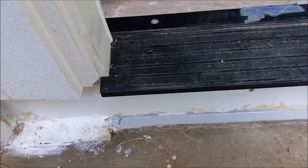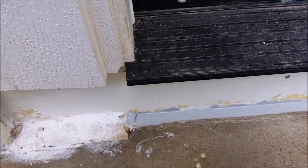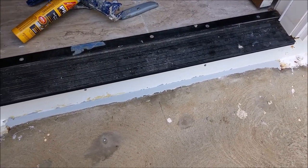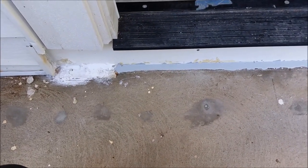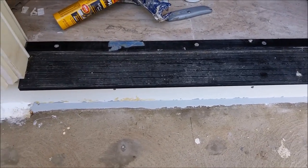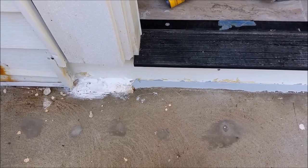If you look at close distance, let me show you the way it looks. Look at that — that's it, it's done. Now I'm going to leave it for one hour. It will cure in 24 hours and it's going to be like a rock. So it is very important that you seal an area like this, especially where there is the entry of doors. There is a crack, and this crack has water going into it and creates moisture, mildew, and these attract termites to come from under. So this will stop the water from going into this hole forever, and you're probably not going to have termites for the rest of your life in this area at least. That's it.